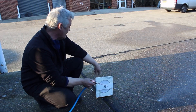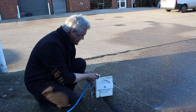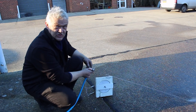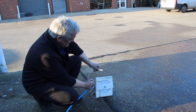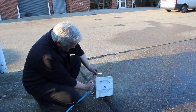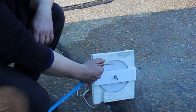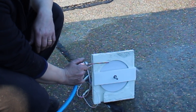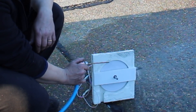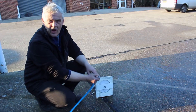It's connected to a NEMA 17 stepper motor used as a generator. When we direct the jet it's going to generate electricity — and there we go. The angle of the water is important: put it at too steep an angle and it slows down. Get it out towards the edge at quite an acute angle and, as you can see, it's producing quite a lot and spinning like crazy.